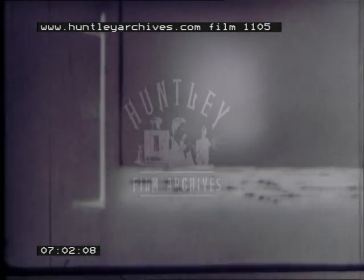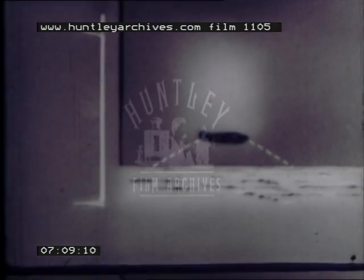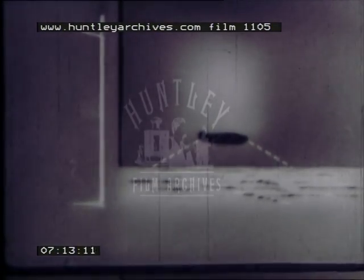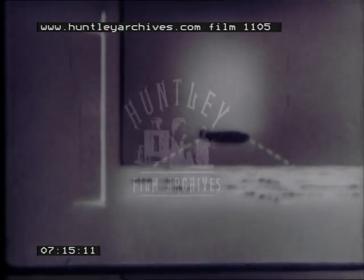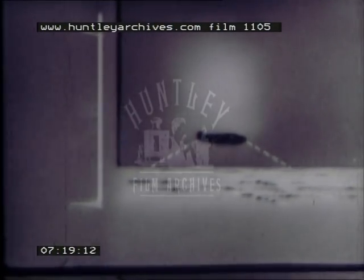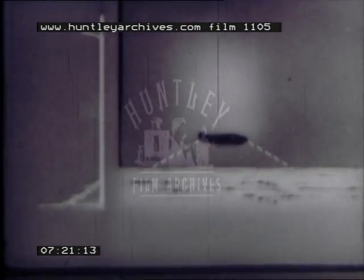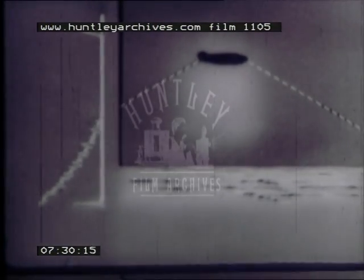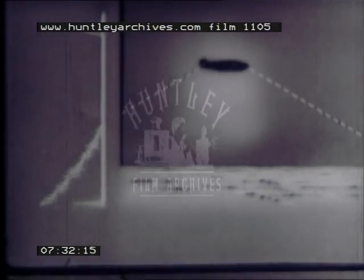But there is still one thing wrong with this picture — we've not said anything about the sea itself. The sea beneath us, and for some way all round, will send our pulses back to us as echoes, or rather as one big spread-out pattern. Our picture should really look like this. All this is what comes back from the sea, or the sea returns. If we climb, we get more sea returns. If we lose height, we get less.